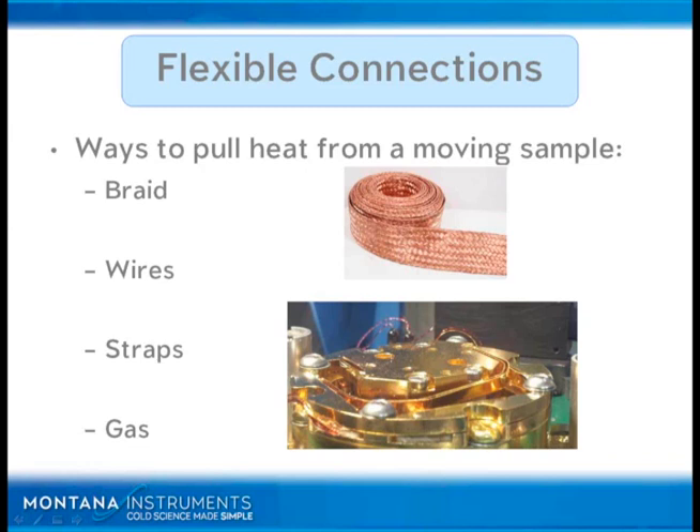That's important because when you're talking about vibration isolation, it's important that you have a very flexible material. Now if every one of those wires has a surface that's a little bit like Velcro and the oxide is growing over time, then you'll have a bonding at the interface between each wire that actually adds to the stiffness. So although this is a technique that's easy to do, it may not work as well as you need for a high performance application.